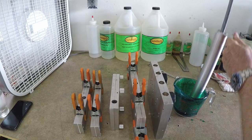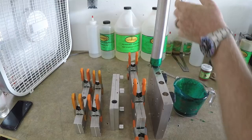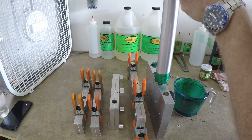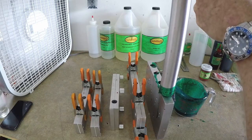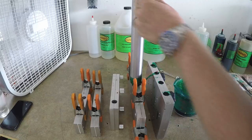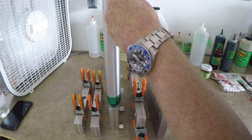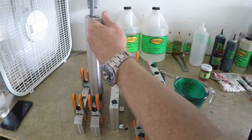All you do is fill it up with the body color — in this case our mean green. I like to shoot this a little hotter than I normally would so it really vulcanizes and infuses with the red tail left in the mold. I really want to hold some hard pressure to get the two plastics to melt back together — that's really the trick. You shoot the tail color, leave it in the mold, then fill it in with the other color. That's how hand injection achieves the split color effect.